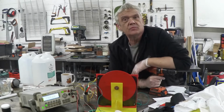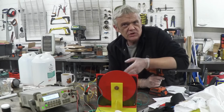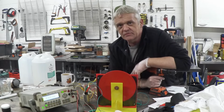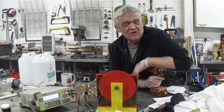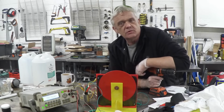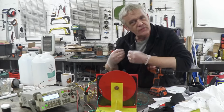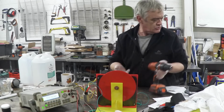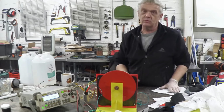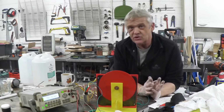So in order to improve the output of this, to me it's pretty obvious. We need an element of pre-charging, which can be resting something on there to get a bit of triboelectricity going, so like cotton wool or maybe carbon felt or maybe a bit of wool. I mean, for sure, if I could have got my cat here, I'd have put her against it to see how she did. But resting against something to pre-charge it with a bit of triboelectricity, or pre-charge it with something like a AA battery, where you just give that little bit of charge just to get it going. And once you get it going, the output shoots right up there. And it's why I think that that flag system is actually working, and when they insulate it, it doesn't, because there's an element of triboelectricity as well as induction.